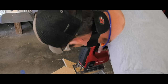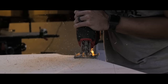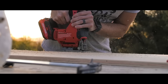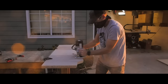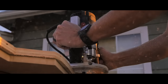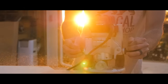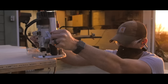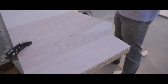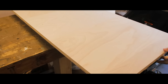From there I took a piece of rough cut three-quarter paint grade plywood and roughly cut a similar shape with the jigsaw, and then using a flush trim router bit on my Craftsman router, I followed the template to create one finished panel for the box. Once I had the one piece sorted out, I knew that I could just repeat this process six more times.